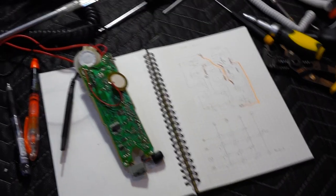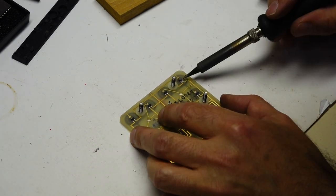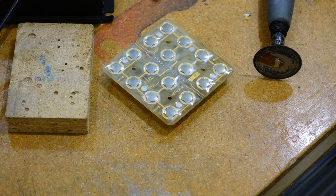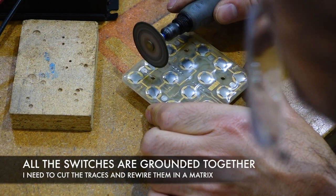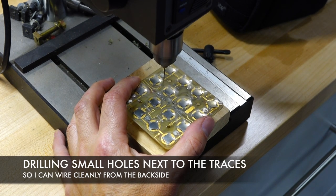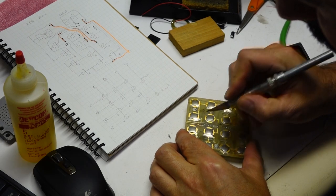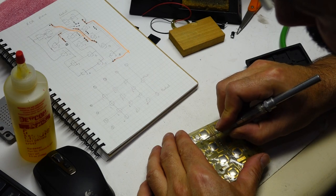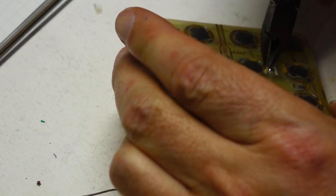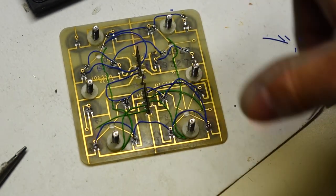They all come on eight pins on the outside — I have to rewire the keyboard over there to match. We need to remove all the diodes, and we're going to do a little bit of demolition. All I have to do is cut a little square so we can solder. It was a good idea to drill a hole next to the trace, and all I do is solder the wire on it. It's all rewired, and it's very clean on this side. Now it's a regular matrix.